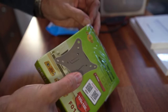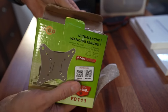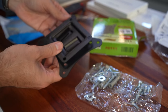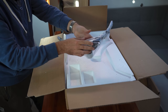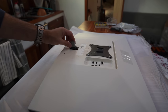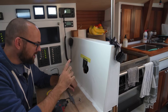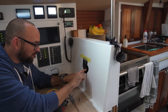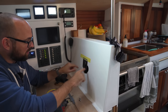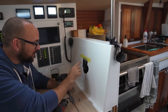The mount for the monitor is a super cheap one off Amazon, but so far it's actually a lot nicer than I was expecting — my expectations were kind of low at only a few euros. The standard mount that comes with the monitor is completely useless on a boat. It looks like there's no easy way of removing the original mount bracket, but we can drill a small hole to allow for the new one. There's also a gap where one of the screws is going to go, but three screws will be plenty fine for now. This winter I can cut a bigger hole and recess the screen in a little bit so it doesn't poke out so far — I think that'll look better.